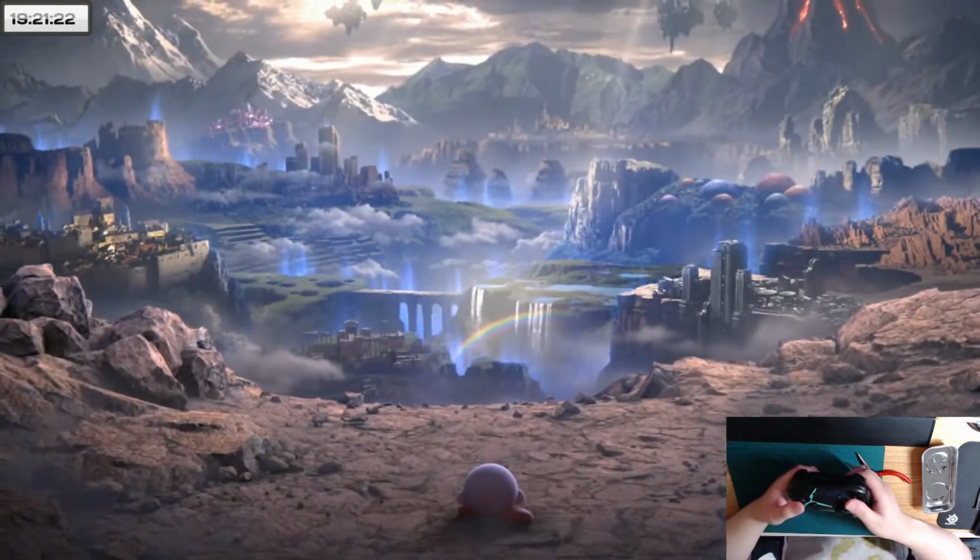So the control stick, when it snaps back, it's a little bit about how loose the control stick is. If the control stick is more tight, it has more force when it snaps back to neutral, and that extra force is what lets it go past the neutral reset position. So tighter sticks will have stronger snapback, and as it loosens, it will become less aggressive. When it resets to neutral, it won't have as much force to get all the way to the other end.